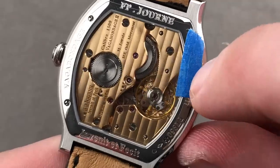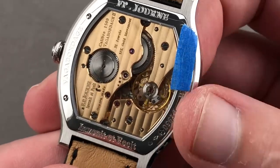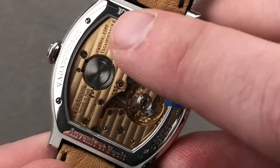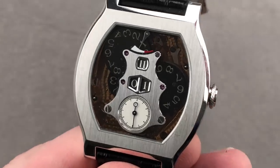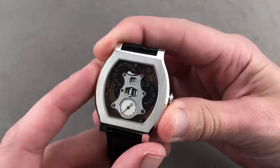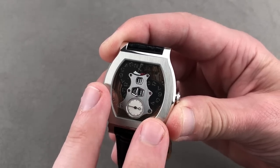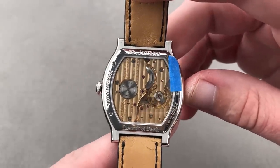You can see the movement is both shaped for the watch and sized for the watch, and made of 18-karat rose gold — an F.P. Journe house special. It's also free sprung and beats at 21,600, caliber 1509, meaning it is 15 French lignes in diameter and 0.9 being the year work started on the movement — that's how an F.P. Journe movement code works. I'll also flip it back over and remind you that there is no branding on the front because the first Vagabondage used a movement F.P. Journe had designed for Cartier. He bought the movement back and put it in the Vagabondage 1, but that one did not meet his standards for precision, so he didn't want to put his name on it. With the Vagabondage 2 and 3 he met his standards, but he had established a precedent, so all three Vagabondage models only feature the brand name on the reverse side.